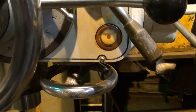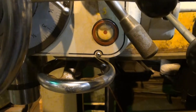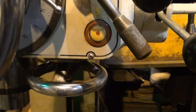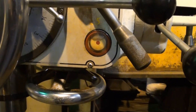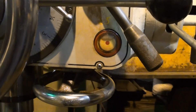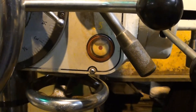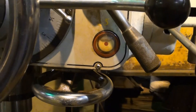By the way Rick, I do want to show briefly that we just changed the oil in the headstock on the machine. When you get the machine the sight glass will actually be covered and it's real clear — it doesn't look like there's any oil in the headstock at all. But when you turn it on, it'll run for just a few minutes and it'll come down to where you can see that there's oil in it.